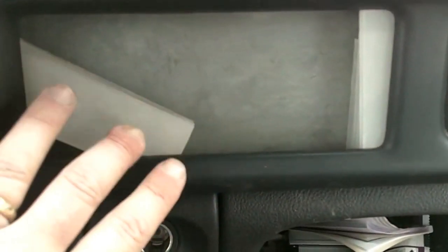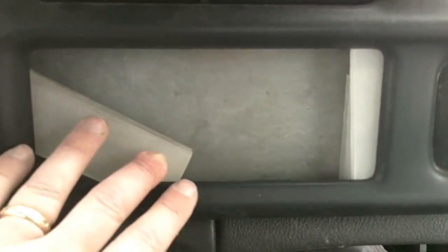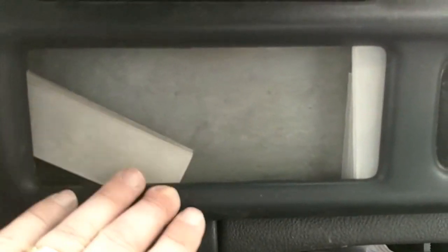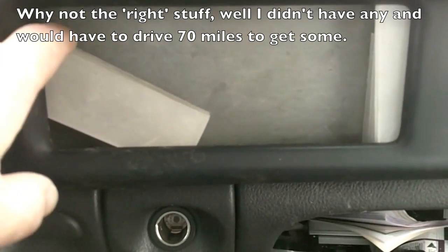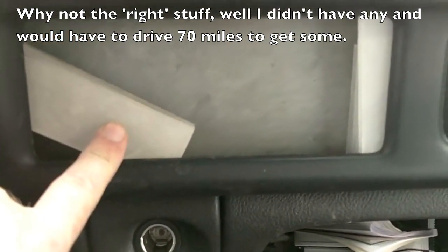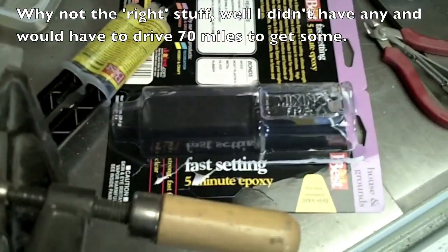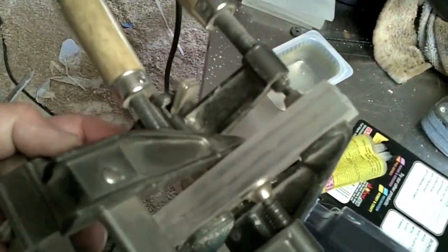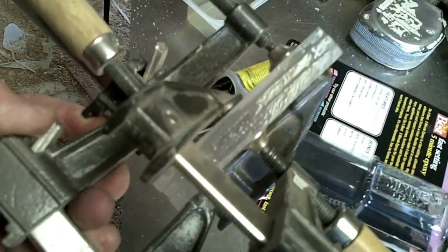This is just a test — I'm going to glue these to the back side of the plate. There is an appropriate plexiglass glue, but I'm just going to use five-minute epoxy. If you prefer, you can get plexiglass or acrylic glue and just wick it in on the joints, press them really tight, and fuse them together — I've used it before and it does work very well. Using simple five-minute epoxy, I've glued my strips together and got them clamped. I'll set that aside and let it harden up.